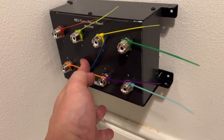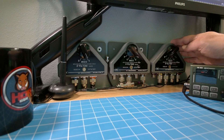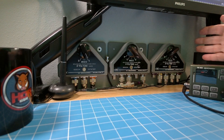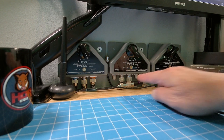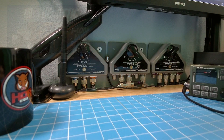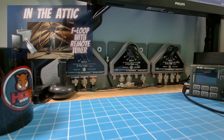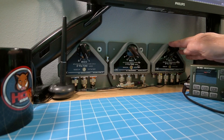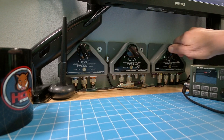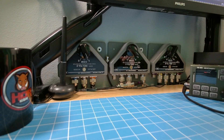And don't worry, we'll get to those color-coded zip ties in a future episode. Now that I have my cables organized through the wall in that MFJ distribution box, I'm going to run them into various switches so I can take them to different pieces of gear. This switch right here handles all of my antenna feed lines — four of them. I have more feed lines than those four. One is currently disconnected from position four and going directly into the attic, connected to my Chameleon antenna F-Loop 2.0 mag loop — I'm doing some testing with it. A mag loop in the attic — imagine that, it's working fantastic! From here I can switch between all four of those antennas and determine what antenna I want coming into which radio.